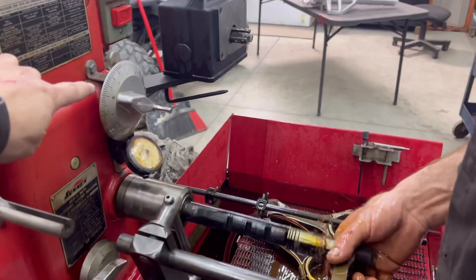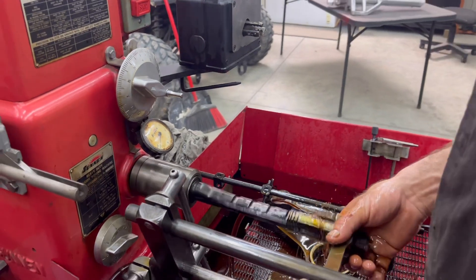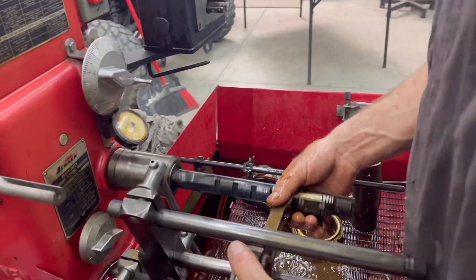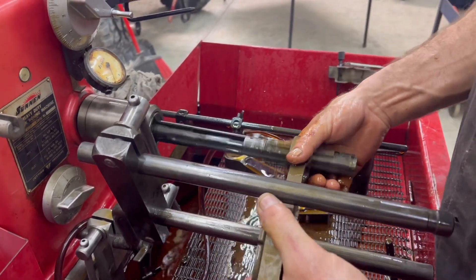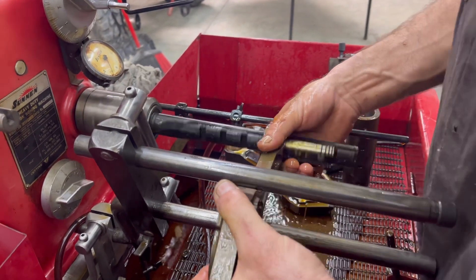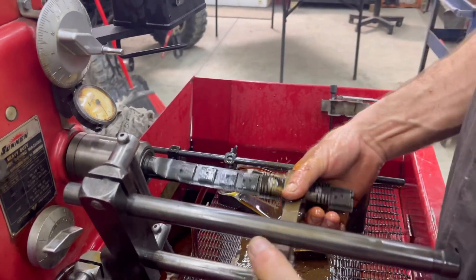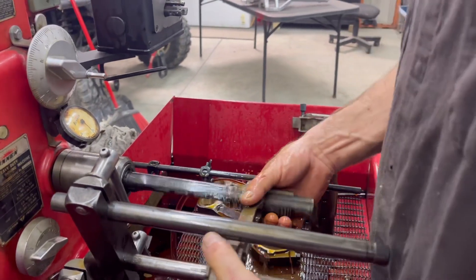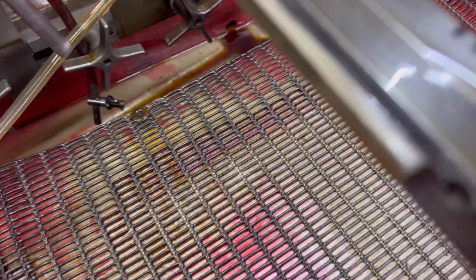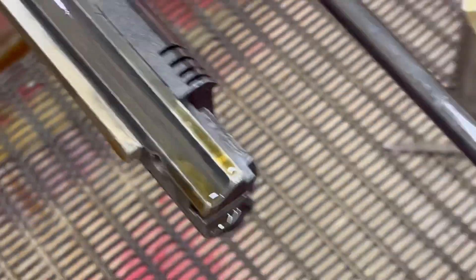I am turning this knob just a little bit and counting. We're at turn 14 on that gauge to go to the rod. We don't know how much actually gets cut out of these bushings to go to size, because the gauge does not tell me how much more I have to go — it's only within a little bit. Our spring tension's at three, roughly. Right now we're counting; when it hits zero again, that'll be 14 turns. We got our diamonds scuffed up a little bit getting a hang of it. I think it won't be too bad, but it's very tiring.